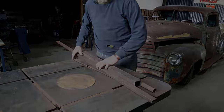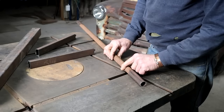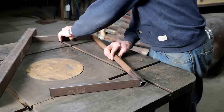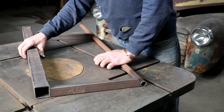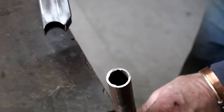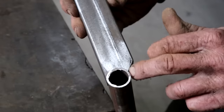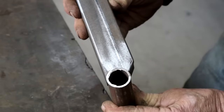So I'm first going to build a frame. This is going to be my bottom piece because it's going to provide a hinge point, this is going to be my upright, and then the 2x2 square tubing is going to sit on top there. So I notched my piece of rectangular tubing to fit over the pipe like that, and on this side I just made a little pie cut and bent that piece in so that it all meets up nicely.